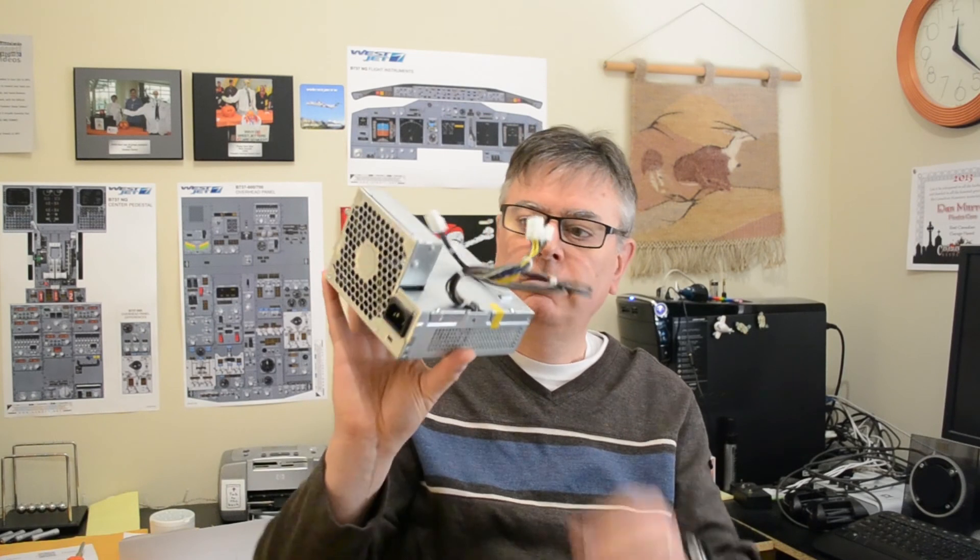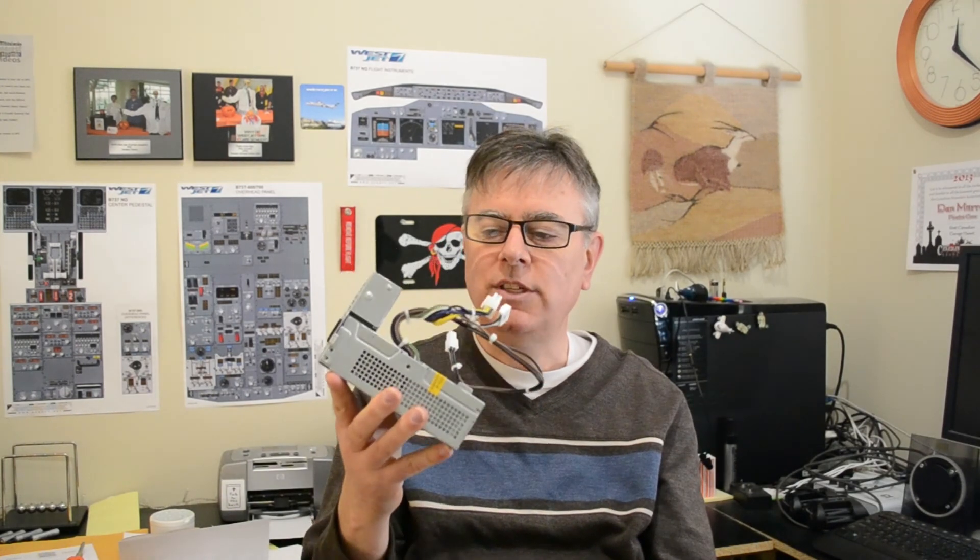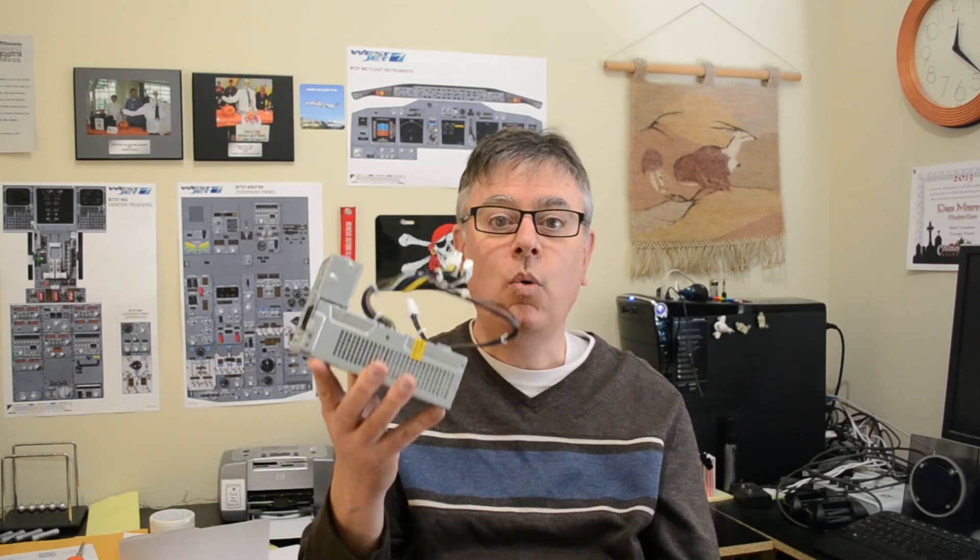You might end up with one of these — the box, wires hanging out of it, looks like a power supply. And you wouldn't be wrong. However, there's one very big difference. These are a very different kind of power supply. Some of the newer PCs, particularly the ones built for offices, are actually wired up so that they only require 12 volts — perfect for working with wiper motors, but if you look for the other voltages, you're going to be a little bit disappointed. So I wanted to show you how you can work with one of these and use it the same way to wire up a 12-volt supply for things like a wiper motor or anything else that needs 12 volts.